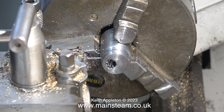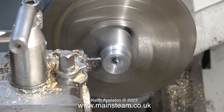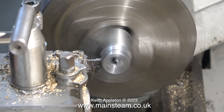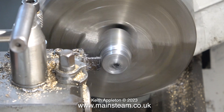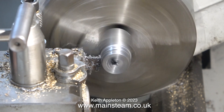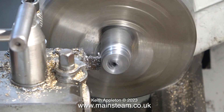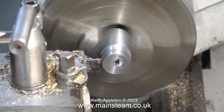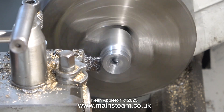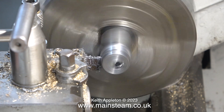I'm more used to making small locomotive type eccentric sheaves, which are different to these. Now I'm machining the other side of the eccentric sheave. I'm going to machine quite a good length of this to the correct diameter because I want to make two eccentric sheaves in case I get one wrong. And looking at the track record of this short series, I have a sneaking feeling that something is going to go wrong at some stage in the process.